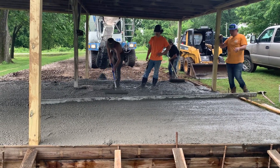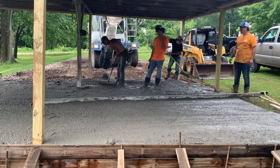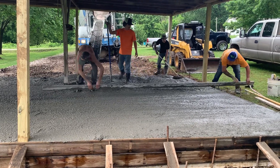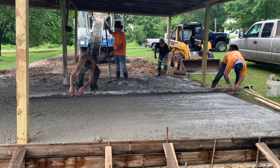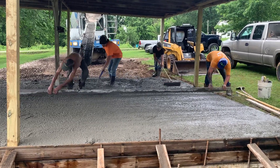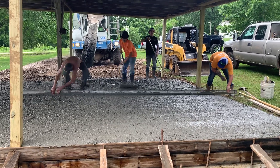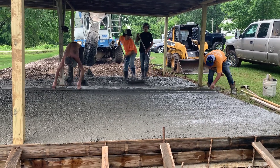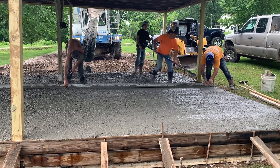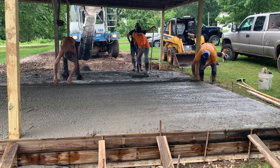They're lucky — when I ordered this concrete, instead of regular concrete, I got chip mix, which the rocks are just smaller, kind of like pea gravel. It's not as hard to rake and rod. Also, when you're cutting joints, big rocks can pick up and leave an uneven joint, missing grout. With chip mix, it actually does a lot better when you cut joints or just work it all together.